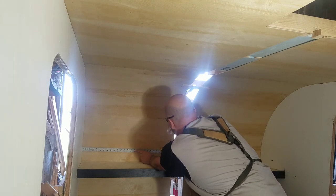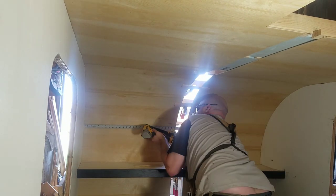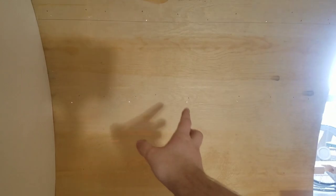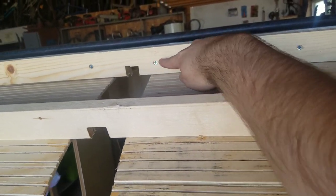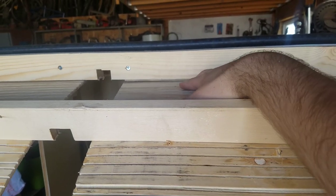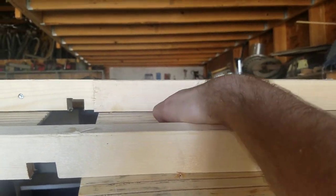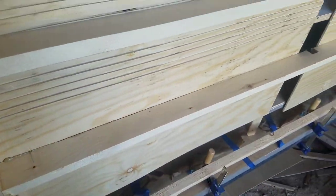What I think I'm going to end up having to do is come in here and nail all the way across, working my way up on this one so that hopefully that'll close that gap a little bit. Unfortunately, when I went over to the other side, there were a few that missed the board altogether, so I knocked them in and restapled those. That didn't get me much extra wood for the top gap, so I'm going to add a little board right here so that I have something to nail this top piece to. And just like that, I've got that piece all the way across with this stapled up there as well - and I realized I forgot to staple the bottom one, which is now stapled too.